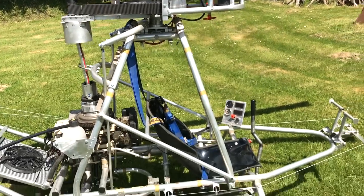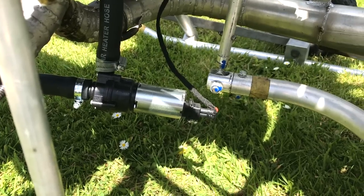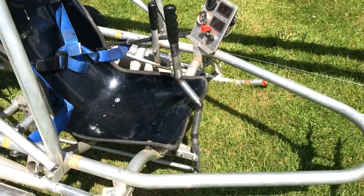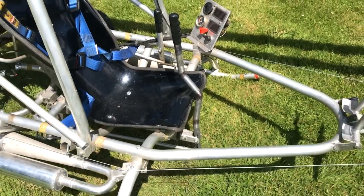With that balance now, I don't expect I'll need the nose weight. I had to buy a new electric water pump because the old one was apparently only rated for 100 degrees Fahrenheit, not Celsius. I've modified the cyclic stick so it's closer to me and slightly taller, and I've also got rid of the play.